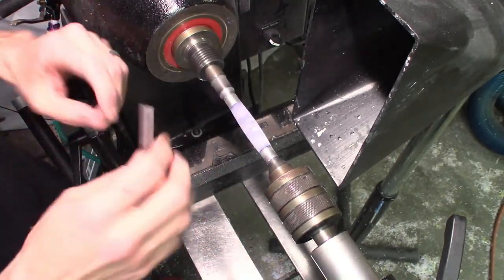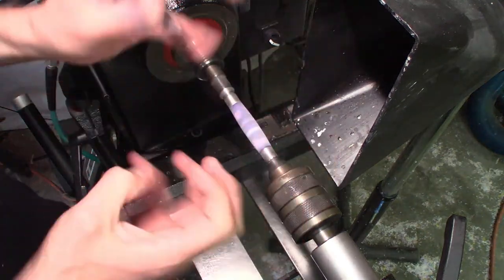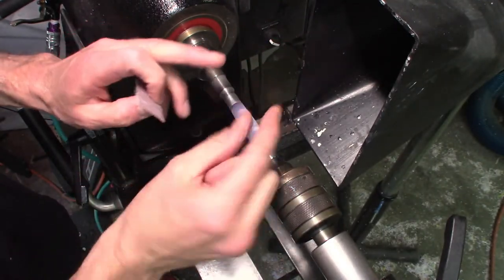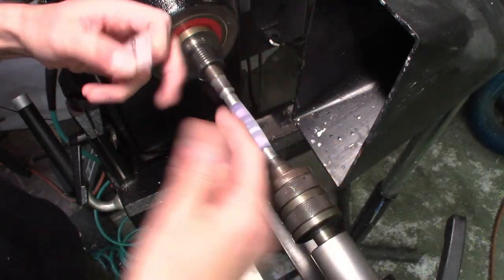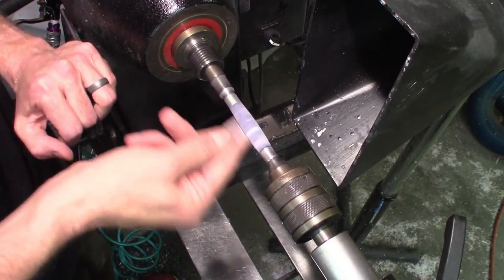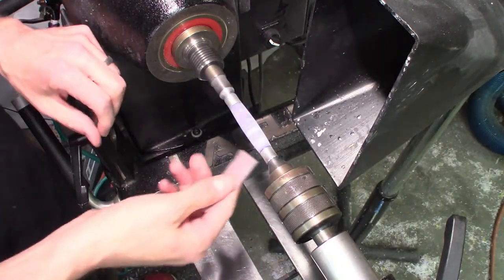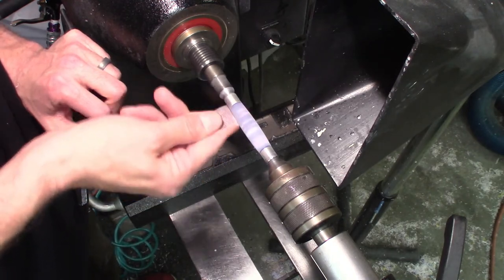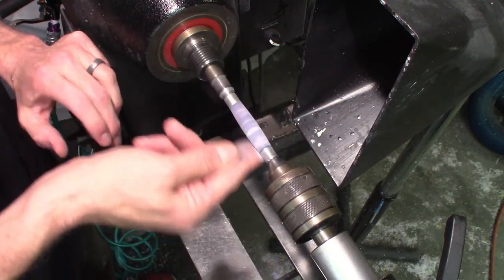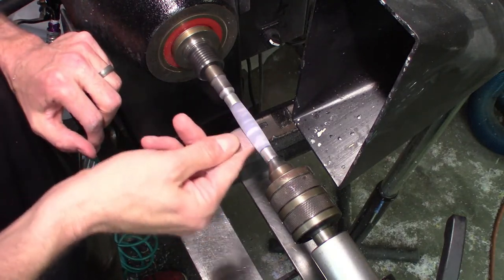That doesn't really work. You can't really print things in midair. That's the one constraint that we have, it's not going to just print stuff without having some sort of support. We were trying to print things where it was just vertical and the hearts would be on the sides of it, but it wouldn't work that way. It would just sag and fall off. You always have to have something underneath holding it up. And again, I was talking about supports and all that kind of stuff. You could maybe print it on its side with supports, but then you got to cut all the supports off and mess around. So all of my models are able to be printed vertically without any supports.